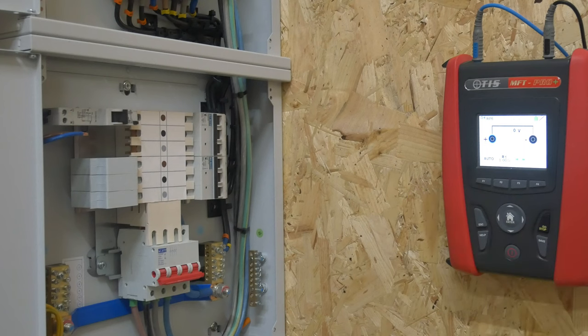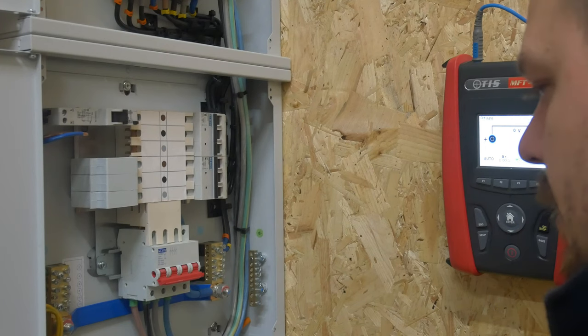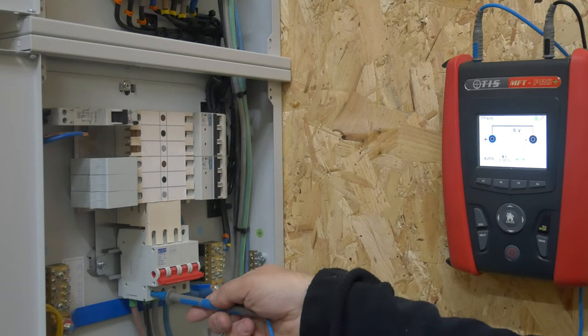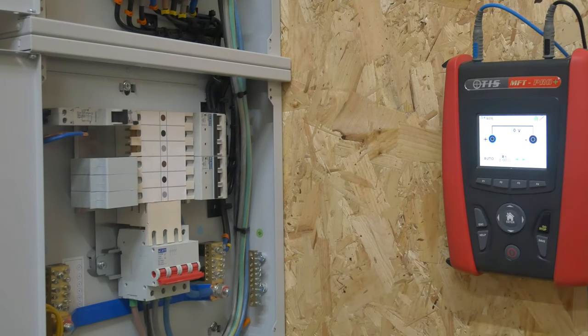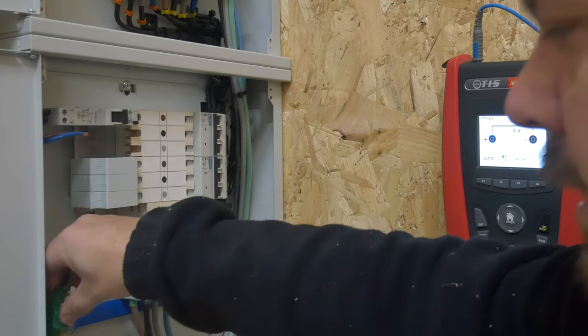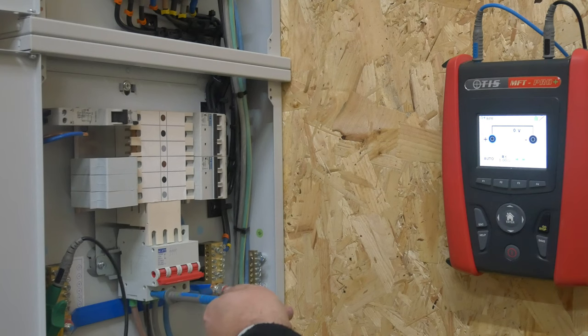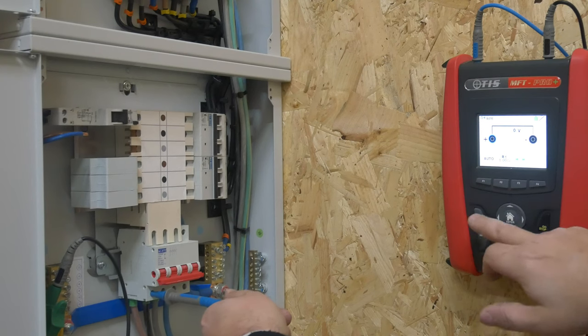Point of note: it wouldn't be a ZE value because we're not at the origin. So I'm going to get onto the earth and onto L1 — I could do that with a clip, easier. I'm going to clip onto the earth bar just in this corner, so we're on there now. Now if I then pop this onto L1 and press to test —